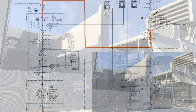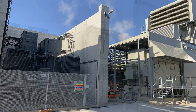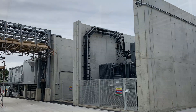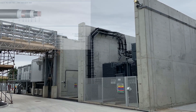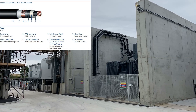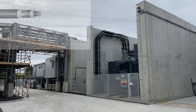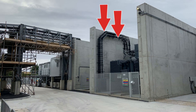We've undertaken a non-intrusive visual inspection of the apparatus and the cabling which is exposed, but we can't see any problems. There is however a smell coming from underneath the generator circuit breaker. The cable connection between the circuit breaker and the 11kV side of the transformer comprises 18 single-core 240mm² 11kV cables. Within the transformer bay, the six trefoil cable arrangements are grouped together on two cable ladders.